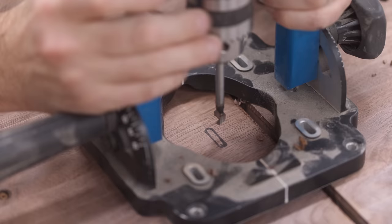For the tambour door I need a door pull that has to be wide enough to catch on the ends of the cabinet. I used a random spray can I had in the shop to lay out a half circle and cut that with my jigsaw. I cut it pretty rough so I could sand it back to the line, and then I needed to add a relief for the finger pull. I remembered I had this little cordless detail sander that was the perfect size, and with some 80-grit sandpaper this worked surprisingly well to make that finger relief.